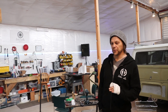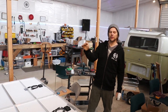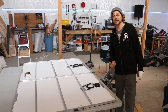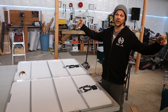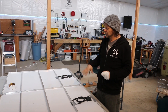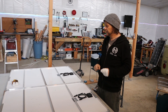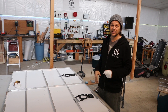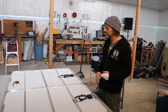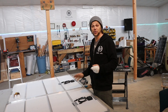These are the four arrays that are going to be hidden underneath the surface panels on top of the VW. They are the awnings which pull out sideways — two on each side, for a total of four. They're about 490 watts each, so multiply that times four and add that to the top panels, and you get just under 3,000 watts.